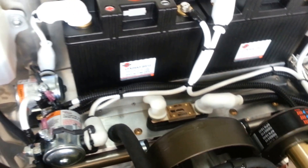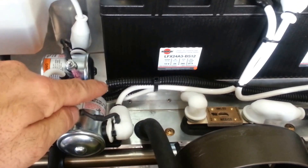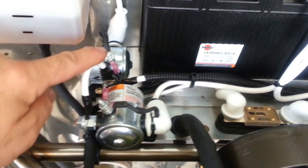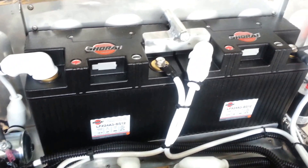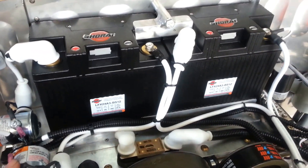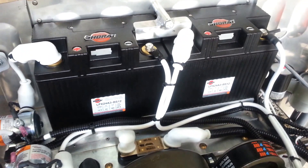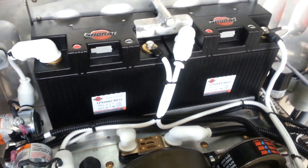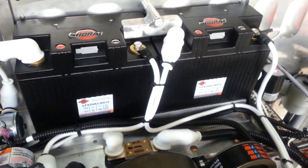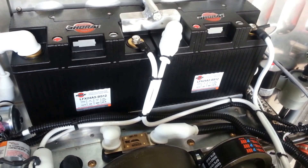The power leaving — we already talked about the alternator — that wire is coming in from the alternator and being either split to this battery or the other battery, depending on which one of these solenoids is closed, charging them. Or, if both switches are up, you're charging both batteries. Of course, if you have both of these connectors closed, meaning both batteries are hooked up and available for starting the engine and being charged, you in essence have one battery. So if there is a problem in your electrical system and you now have a short, you will wipe out both batteries. That is not recommended.